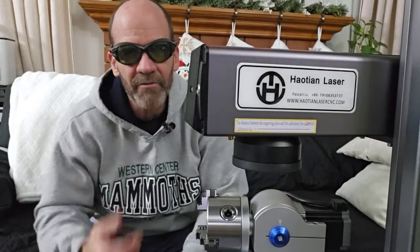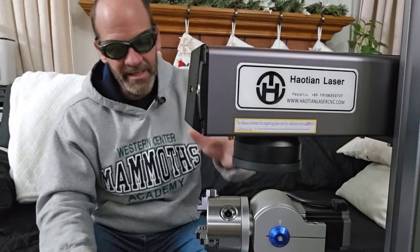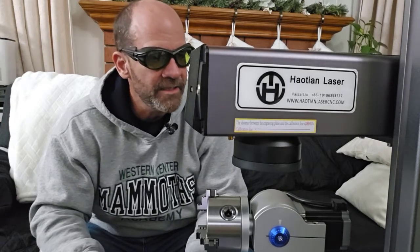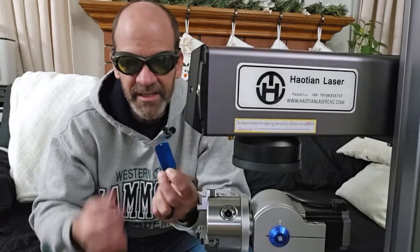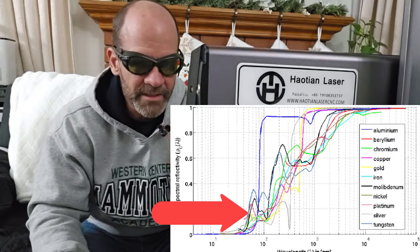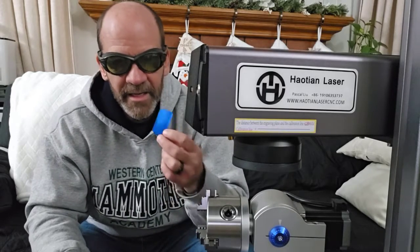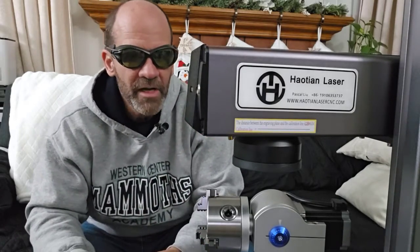You always have to wear your glasses because this is not enclosed and the laser could bounce off something and get in your eye. I'll often have my glasses on and stack some things around it to make sure nobody walking by gets hit by a laser beam either. The fact that fiber lasers can engrave and cut metal means the laser is absorbed by that metal — it's a different frequency than visible light, so it gets absorbed and reflected differently. Metal absorbs it, which is why it can engrave and cut metal, so you don't have to worry about the beam bouncing off the metal itself.